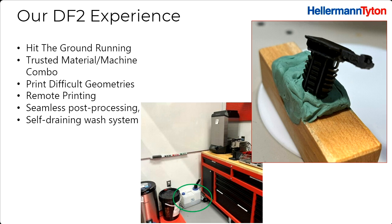This is one of the best features between Loctite and Raise being a partnership: they do a lot of that work for you. So when I get it as the user, I know I can press play and the machine will work out very well. And I won't have to worry about setting up the parameters. Another engineer here does this at home for fun, and he prints figurines for board games. He can sometimes take 5 to 10 prints just to get a processing parameter correct to make sure the part is going to come out and print and stick to the build plate and be successful. And thankfully, Loctite does a lot of that up front for us so that it takes the guesswork out of it.